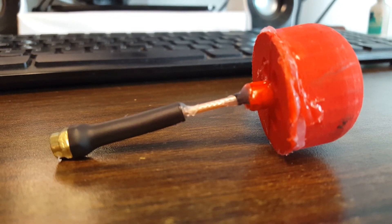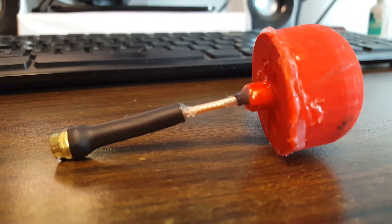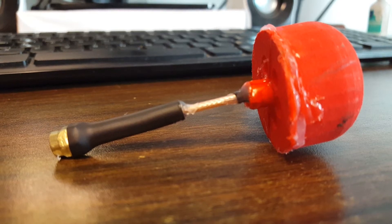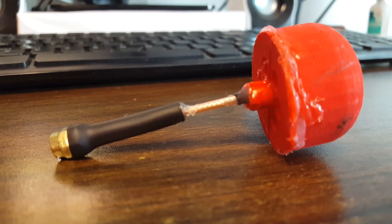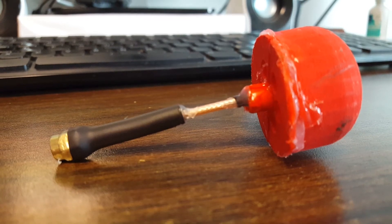Once the insulation goes, the actual metal braided sheath that provides grounding and current flow is gone. It's going to get worn into, and then that's just it for your antenna. You really can't take a chance on that happening.